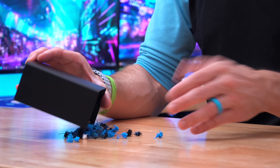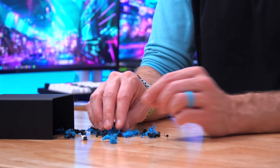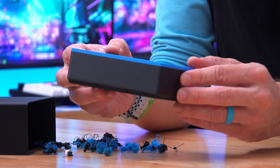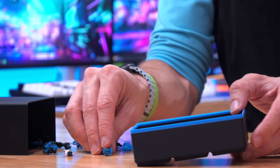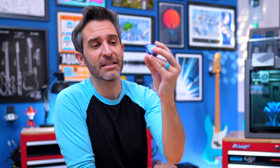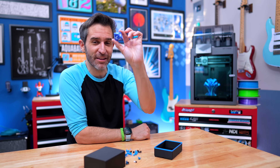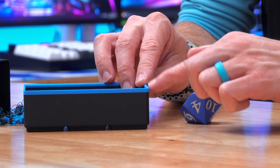The reason you need this is that every time the printer starts a print, changes a color, or changes a material, it produces one of these little poops — little bits of waste. If you're doing a single color print, that's not bad. If you're doing multicolor, it doesn't necessarily mean there's going to be a lot. Something like this container is multicolor, but it's super simple because the printer printed all in black until it got to the top, then switched to blue. So it basically just produced a couple of these little things for the whole print.